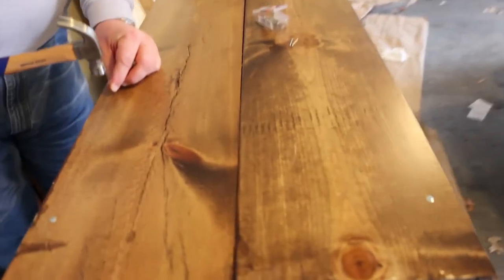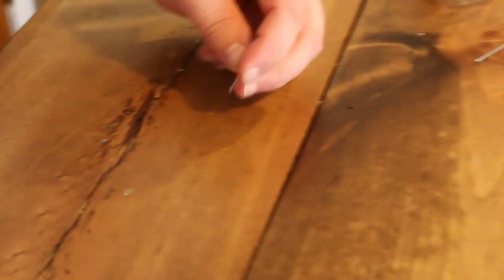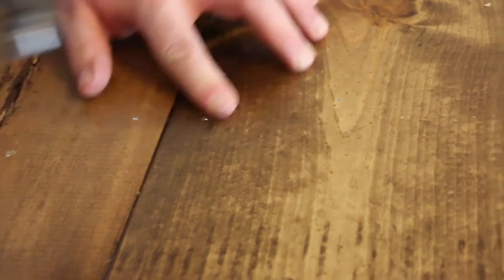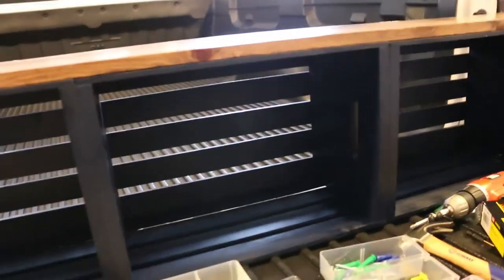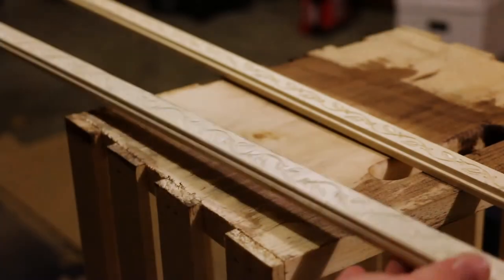For the rest of the bar on the insides, we used a few nails along the thick parts of the crates underneath the bar top, because we didn't want to put screws everywhere since they were showing. Small nails that weren't so obvious secured the middle part. We also used nails to secure the bar top to the three crates that sat on top, and then we nailed the top three crates to the bar top. Since that part isn't load-bearing, nails work just fine.